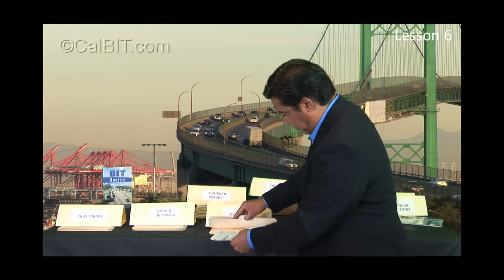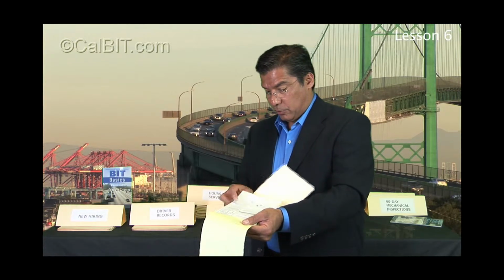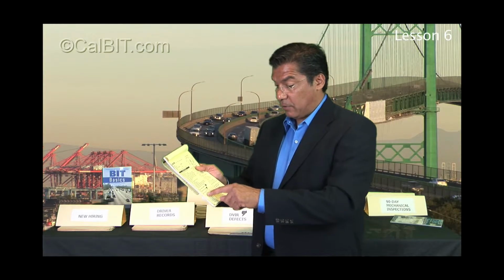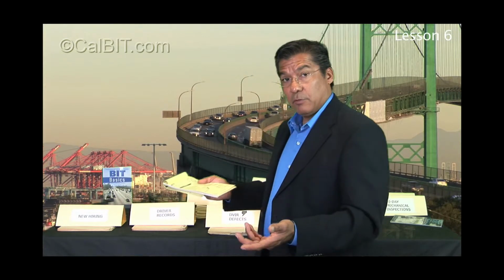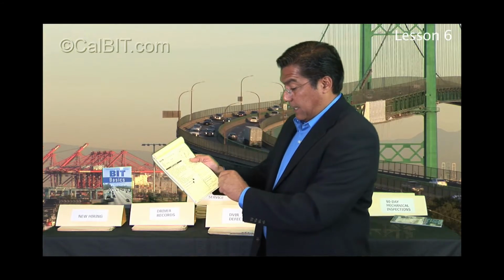Let's say that this one's for this truck down here in that area, and then when the driver comes in on the next day's dispatch, the driver will be ready to start their new report. So they'll get their new report ready to go. But before he or she does anything, they look at the last report, see the driver has signed a report that says there was a defect found, a nail in the tire, repairs were either unnecessary or necessary, and they checked it, signed it, a vendor or somebody signed it, and then the driver even goes out and looks him or herself and sees, okay, yeah, no nail, everything looks good, the tire's in good shape, and signs the bottom.